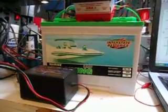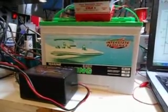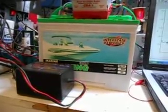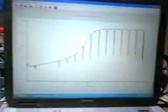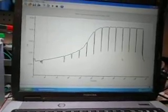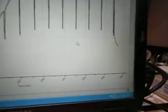This is my second charging of this battery. Last night I charged it for six hours initially at 2 amps constant current from a power supply — from 11 in the evening till 5 or 6 in the morning. When I woke up, I then put the Bedini Renaissance Charger on, and got this charge curve until the charger peaked the battery at about 15.6 volts. Then it shut off and dropped back down to about 12.5 volts.